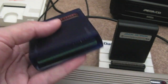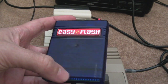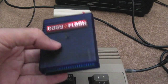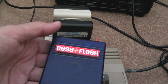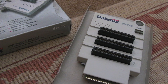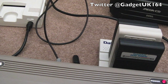I'd be interested to know your thoughts and opinions about the incompatibility with this — especially anyone who knows more about the chip select signals: GAME, EXROM, ROM HIGH, ROM LOW — please post in the comments below. In the meantime I'll go and do a bit of research because I've got that board to assemble from Mindflare Retro and another one of these to assemble at some point later in the year. Despite its limitations, that wasn't a bad pickup — I think it cost me six pounds in total. All three standard carts work fine switching between slots, so it behaves as you would expect. Anyway, I thought you'd find that interesting — thanks for watching, I'll see you soon.